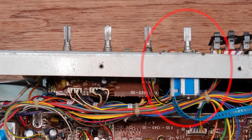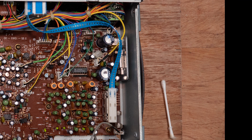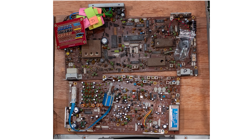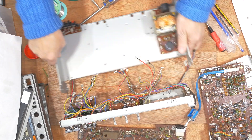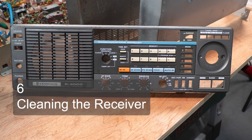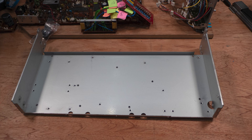The PCBs are held to the chassis with multiple screws running through metal standoffs. I removed the top PCB first, having disconnected all the wires and removed the screws holding various sockets onto the back panel. I followed a similar procedure with the lower PCB, detaching the attenuator switch from the sub-panel as I wasn't sure if the lead was releasable. I was pleased to find the optional CW filter already installed. Removing the chassis and releasing the sub-panel was a significant moment — the radio is about 40 years old.